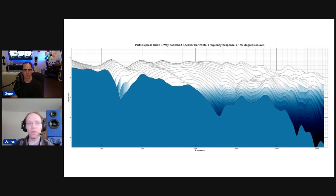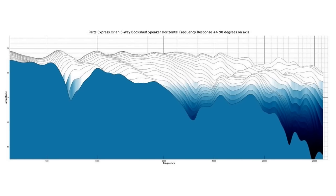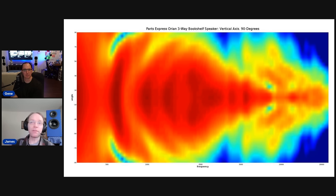Here's the same data in profile view, giving a clearer look at individual angles. On-axis is where you really want to be, but if you're off-axis there are some treble flares that shore things up a bit — so even off-axis you'll still hear treble, just a slightly uneven response. It sounded fine and was very listenable. If you want more treble, I'd only boost it about 2 dB using a tone control — but I didn't feel a need to since I prefer a warmer sound signature.